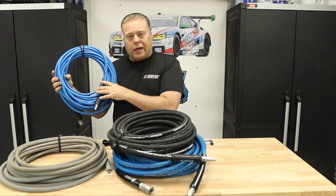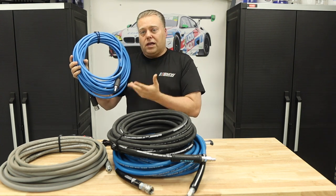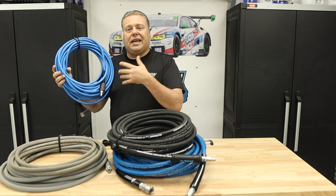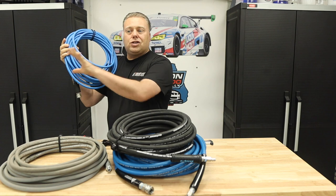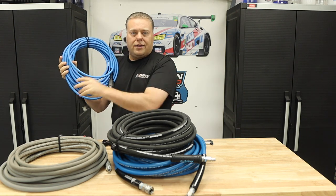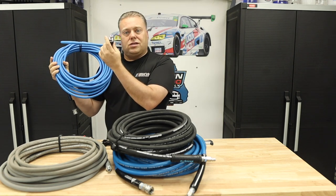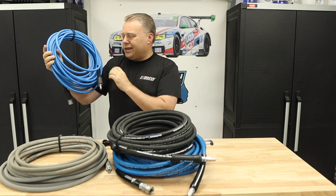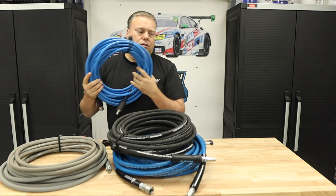This is an Uberflex hose — it's quarter inch, so it's much more like your stock hose. It's a very easy upgrade for most people just getting into pressure washing because it already comes with M22 fittings just like your stock pressure washer. So you replace the hose, use your stock gun, then down the road upgrade your gun and get some quick disconnects. I'll leave a link below for a kit — it's a great way to get into the game.